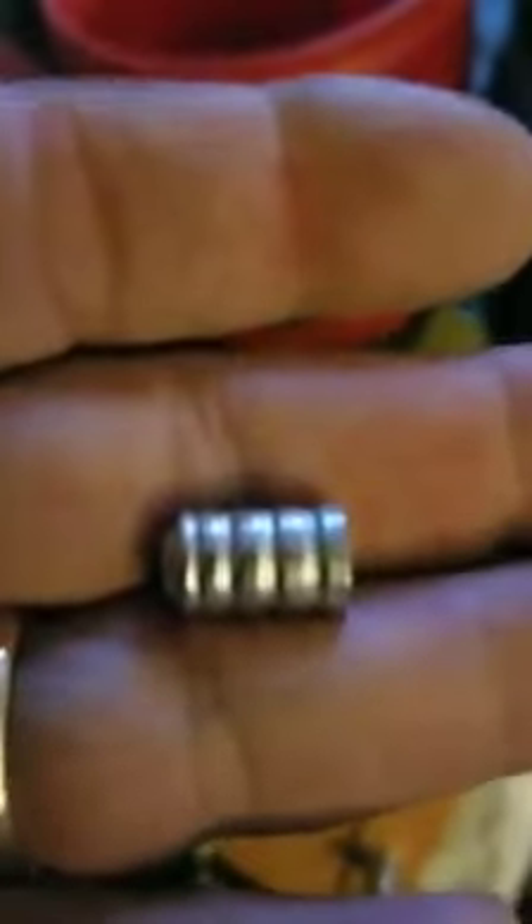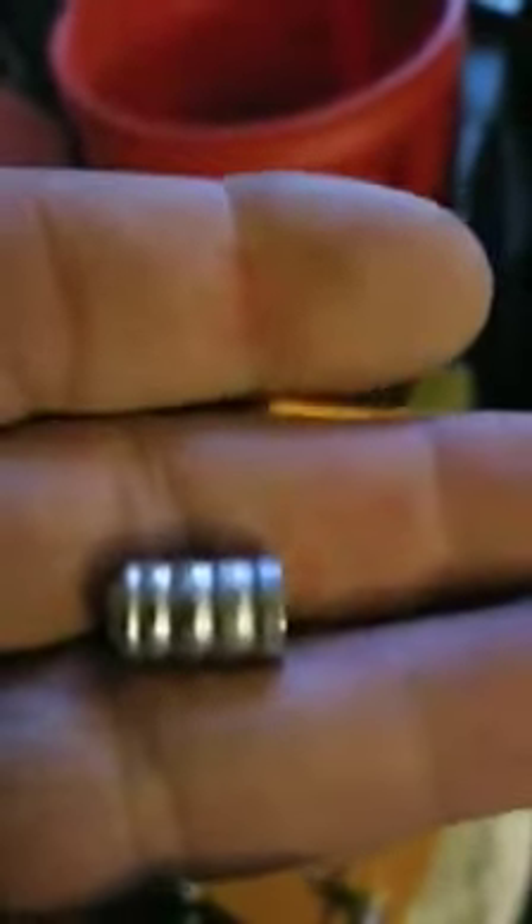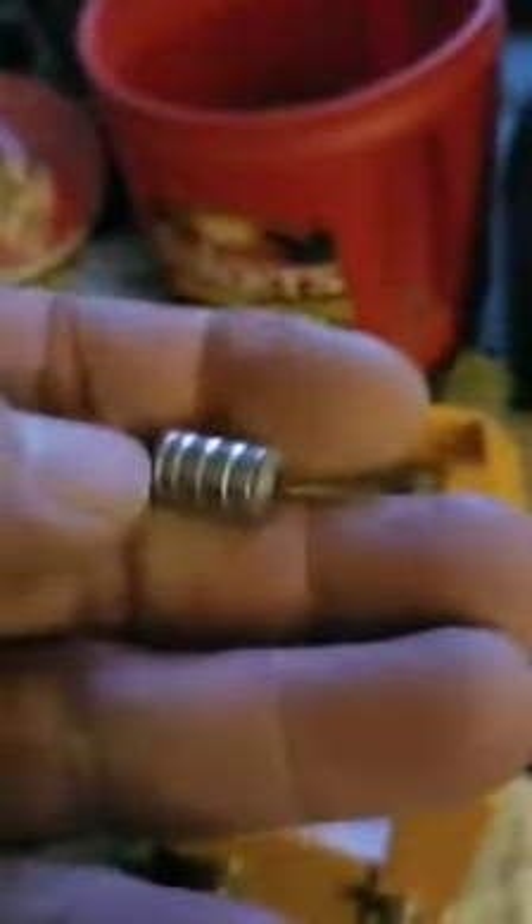So I cast them like that. Now normally what I would do is use a lubricant on them, which would be a petroleum-based lubricant. I would either pan lube these — put them in a pan and pour the lube around them — or I would tumble lube them with a mixture of ALOX and a couple different kinds of waxes and some mineral spirits, and let them dry.